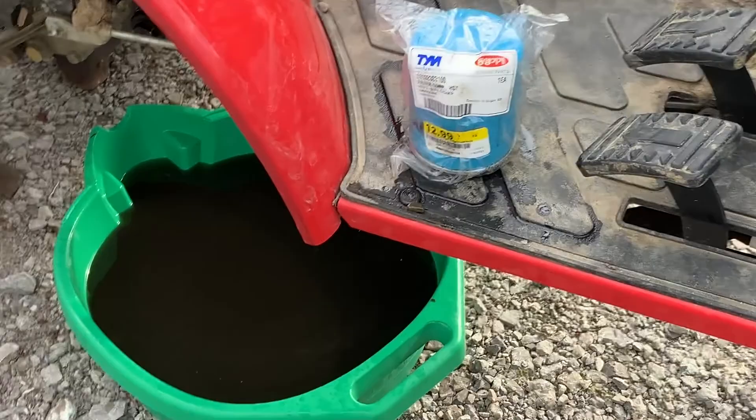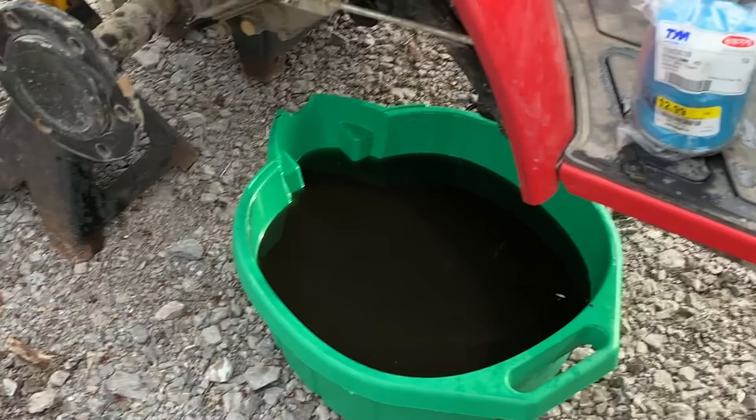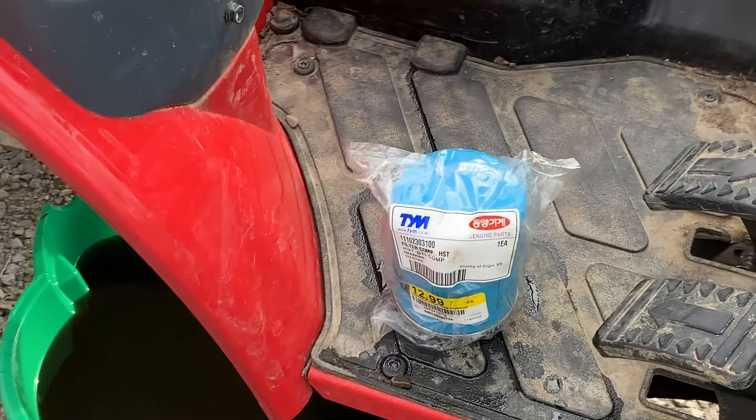What you can do is go to any RK — not the service desk at the front of the store, but back where they sell the chainsaws and have all the brochures for the tractors and four-wheelers. Go back there, get an employee and say, this is the tractor I have, I'm going to do the 50-hour maintenance on the RK24. Just tell them, can you print me out the parts list? They'll look in their system and print it out, and it'll say exactly what you need for your 50-hour, your 100-hour, or whatever. It'll give you a SKU number and a price.